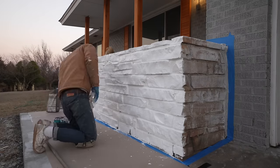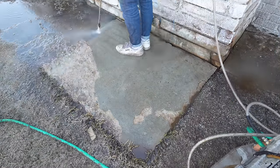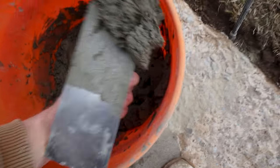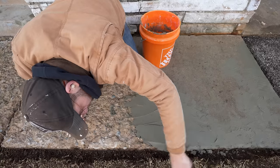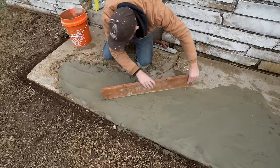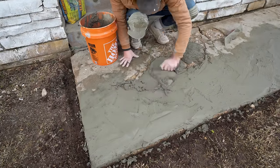I'm happy with the look — it freshens things up. Now we're going to break continuity and go backwards to show how I fixed this sidewalk, since this project took over a week and I was doing all the other steps simultaneously. After clearing dirt from the edge of the concrete I mixed up some vinyl concrete patcher by Quikrete — not the resurfacer for the flood coat, but to backfill negative spaces and get things flat. This is one of the worst sidewalks I've seen: a really big crack down the middle plus severe water damage from the house having no gutters for 50-60 years.